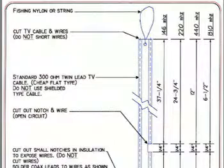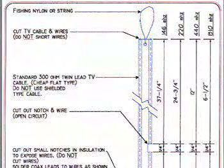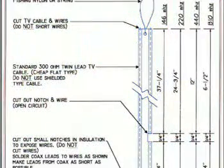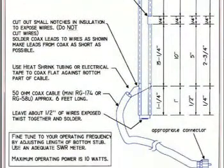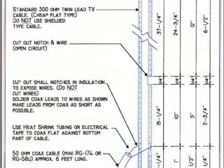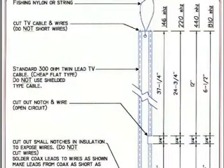The next resource to look at is called the Emergency Ladder Line J-Pole Antenna — it's a PDF file I will link to. It gives dimensions on how to design different ladder line or twin lead J-Poles for specific ham radio bands with no calculator, just pre-built mathematical calculations. The main benefit is they don't take up much space — you can roll them up, and you don't need any copper or metal pipe, since the ladder line is very flexible.